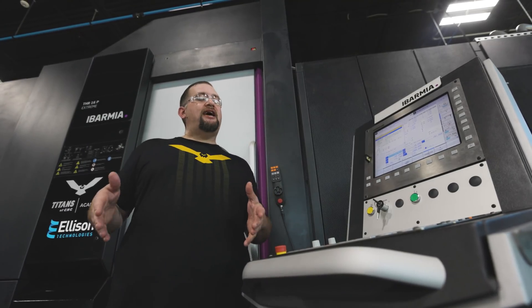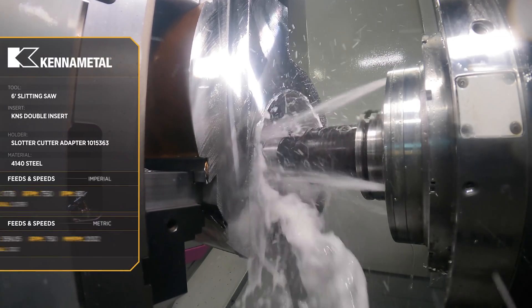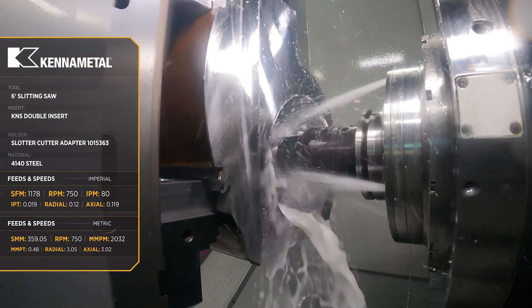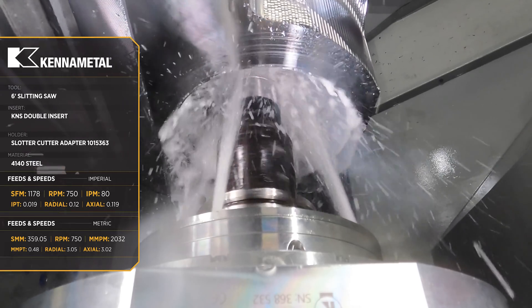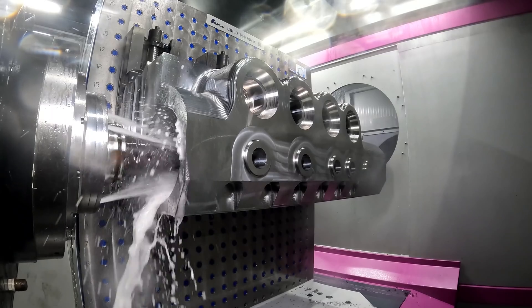For the second side of our part I decided to just double our feed rate instead of tripling it. And as machinists, that's something that we do when we're unfamiliar with a tool — we start off slow and then push it beyond what we think it's capable of, but not so far that we end up destroying the tool.